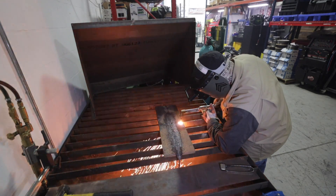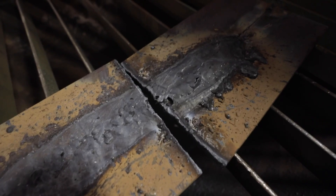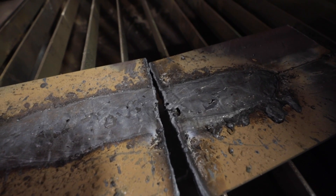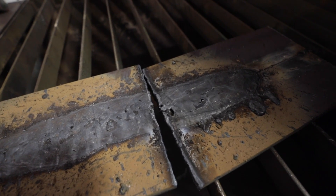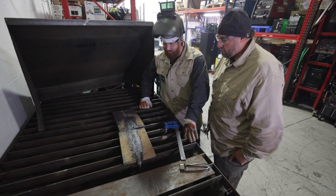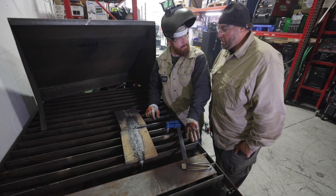When I was cutting there it kind of blew back a little bit - we've got a large porosity pocket right in there. As I was cutting through it, it almost snuffed the flame out, so I changed direction and cut from the other side right into it and it just released - almost like trapped gas that was in there. It's a very unique process. I don't know how much detail they go into for post-weld cleanup other than chipping the slag out and throwing the slag pot back into production.